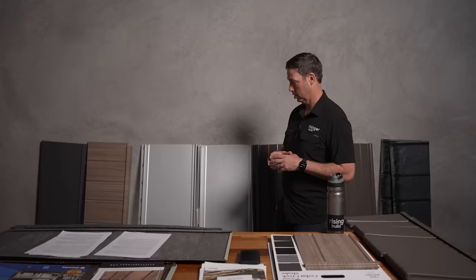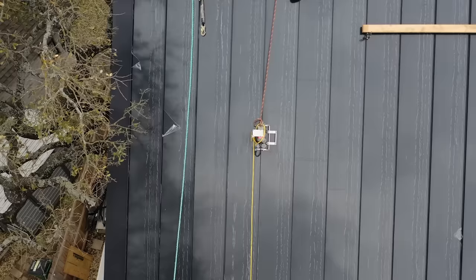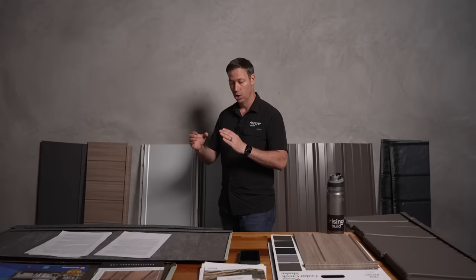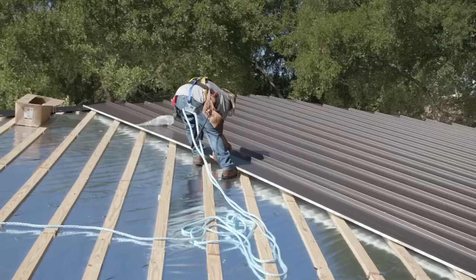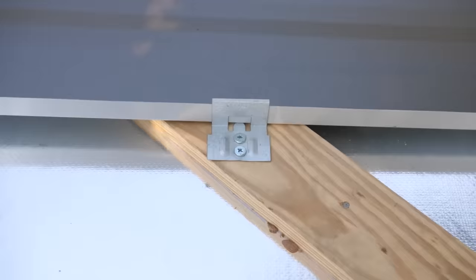But there's several different flavors on these, from this one right here where you're gonna put a seamer down there and it's actually gonna crimp over. That's more of what a standard standing seam metal roof would be called. But there's also a bunch of versions of this that are snap lock, and that's what these panels are right here, where one rib sticks up, and then the next one snaps over top and is actually screwed down to the deck. That's what I think of, and that's what I've used a lot of over the years.